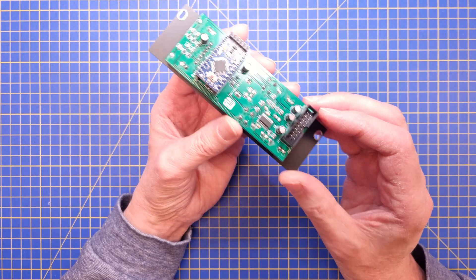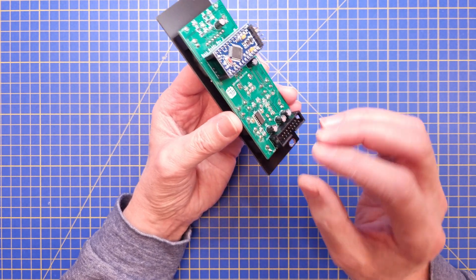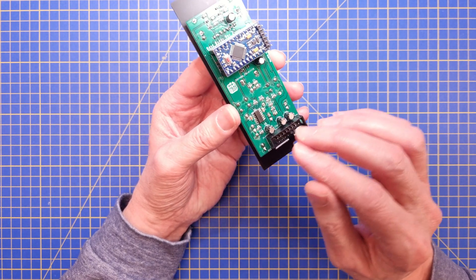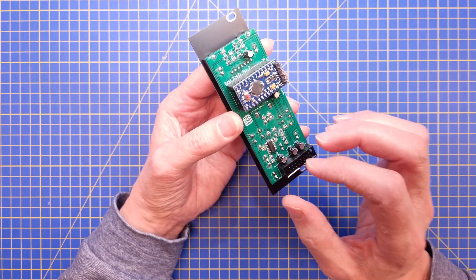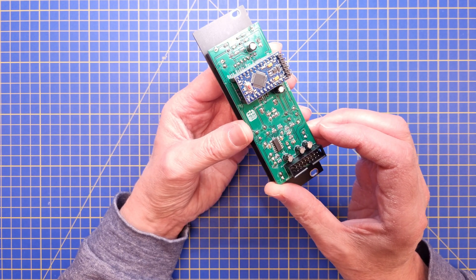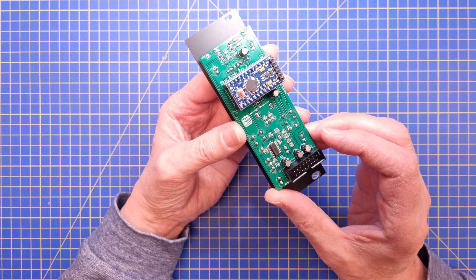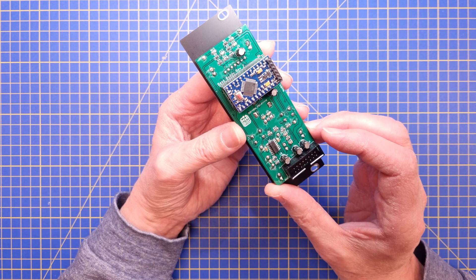When I decided to design it like that, I thought it was a great idea because I wanted to separate the 5 volt — with the microprocessor and the logic — from the 12 volt, which is used for the analog part. So it kind of made sense to separate them.